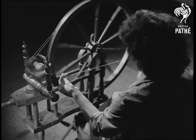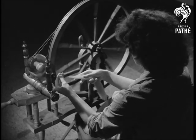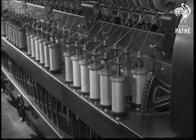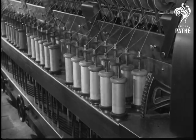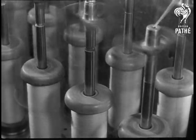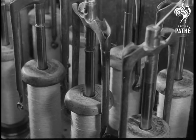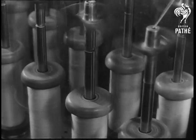In modern mills, the processes of spinning are all mechanised, but what is done to the fibres is really much the same: drawing out, twisting, and winding on. We'll look into a modern mill. What a contrast. But we can recognise upright spindles, flyers and bobbins. The fibres enter and leave the flyers as in the treadle wheel, but there are no hooks on the flyers — they move up and down over the bobbins instead. And it has needed the efforts of many generations to produce the change, but what is actually done to the fibres remains the same.